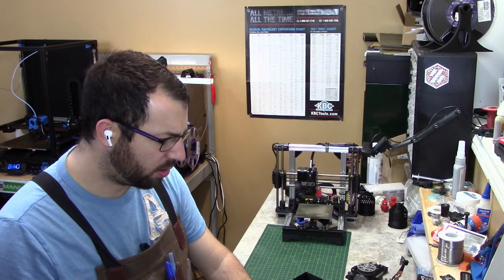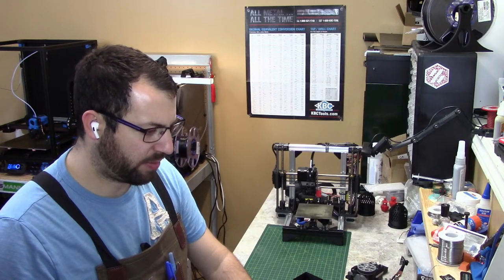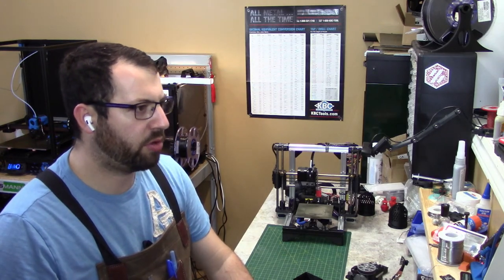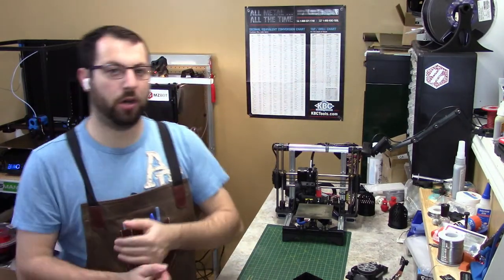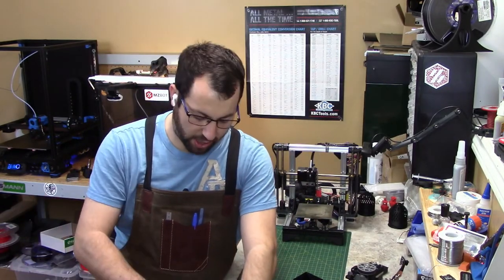Did I upload it? No, I don't think I uploaded it. But yeah, I have videos on my channel of doing 300 millimeters a second on my printer. But the problem is, you can only go so fast when you're melting plastic, right? You're taking a solid plastic, you have to convert it to not a liquid, but a state that you can extrude it, and then you have to re-solidify it.